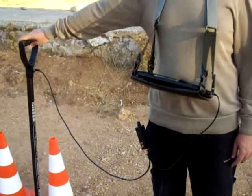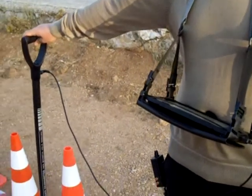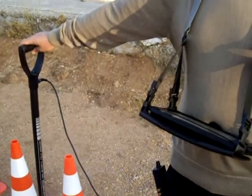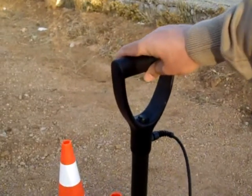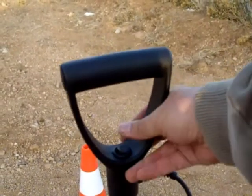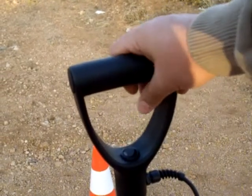Before starting a new scan, the first square must be on a piece of ground that is not being dug and free from metal. Extend your arm away from the screen and your body. Place the magnetometer tip on the ground, far from any metal. Power on and wait 15 seconds, completely motionless, while the Geo Examiner will automatically zero the soil data and then start scanning, with the magnetometer tip touching the ground on each step.